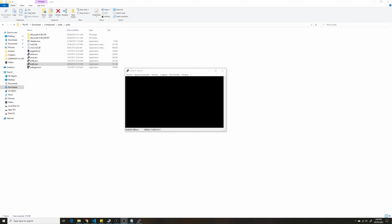The first thing I should be doing is passing an AT command to enable the upload: AT+UFWUPD=3, and you have to be patient with this. You have to wait a couple of seconds before it can give you any response. Once you send this command, you should be receiving a response from your modem, and that's how it looks like.